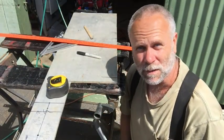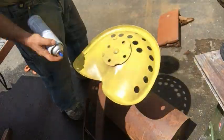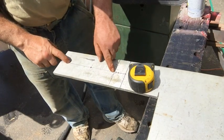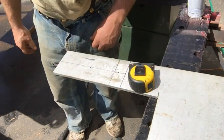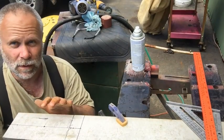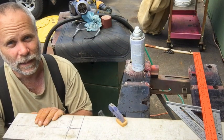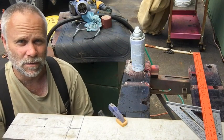Now the paint should be dry enough on the bottom of the seat to put a finished coat on and let it dry. To make this easier, I'll go ahead and put the holes in before I cut this off, while I have a lot of metal out here to hold it in place — I can just clamp it with a quick clamp. Now I have to determine what size holes to make, so I'm going over to measure the slots on the springs on the tractor and size up the bolt on the seat itself. I think they're going to be the same size, maybe like a half-inch.